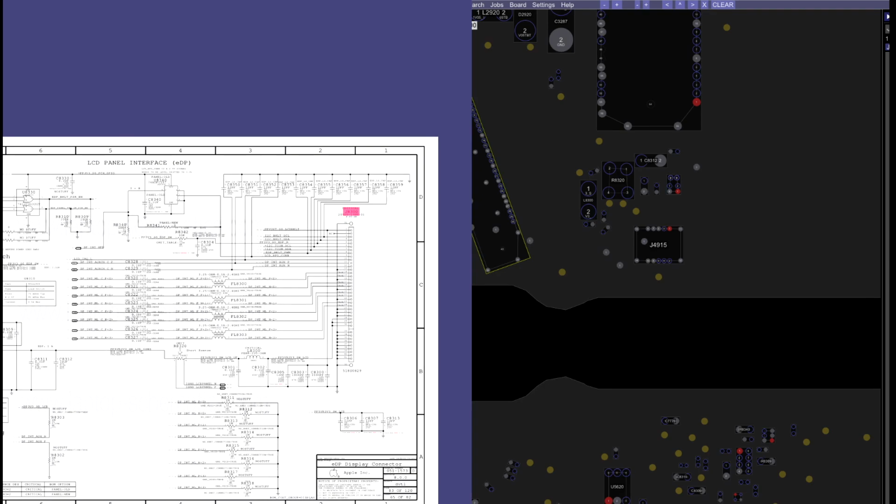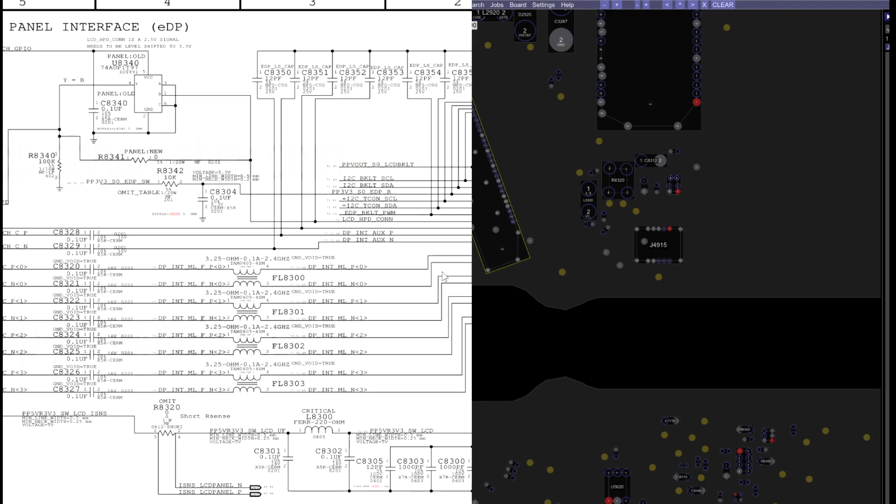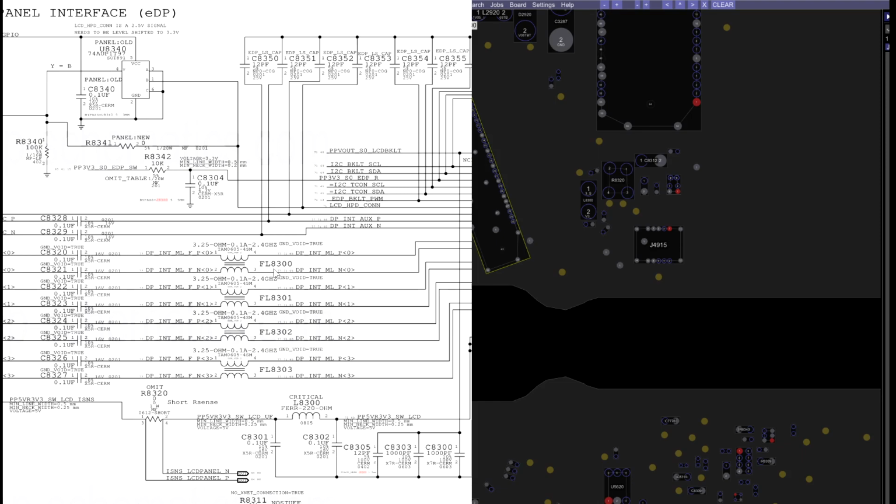Here we go. Check it out. Okay, so now we have DisplayPort lines. The machine is going to communicate with two things. A, it communicates with the backlight chip on an I2C data line, I2C for those who like to be triggered by my mispronunciation. And it also communicates with the CPU, which is where the integrated GPU is, on this data line right here. It goes through a capacitor and an inductor, which act as a filter prior to going to the screen. So the machine is going to speak to the screen a little bit.